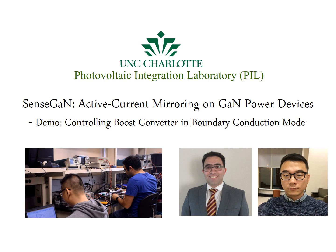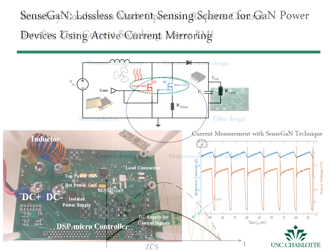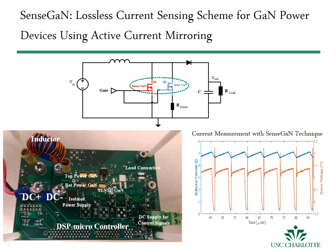In this video, we present a control scheme to operate a boost converter in boundary conduction mode using gallium nitride transistors. In the proposed method, it is assumed that the zero current information is not available for controlling the converter. To operate the converter at boundary conduction, it is required to have a proper control scheme to change the switching frequency, as well as an accurate method to detect the zero current.